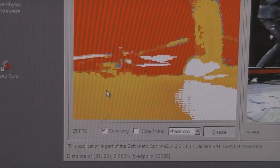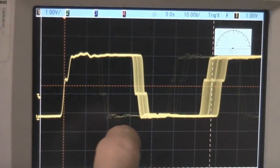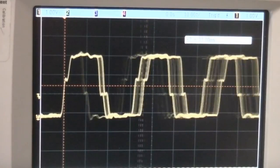In close mode it actually reduces the sampling time, increasing the frequency — it's now in the 27 to 30MHz region in close-up mode. Obviously it doesn't need to leave enough time for reflections to come back from further away since it's only interested in close-up stuff.